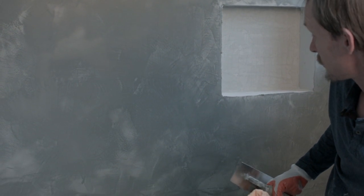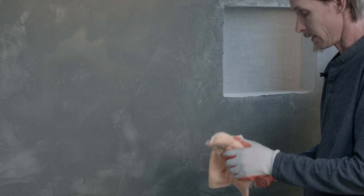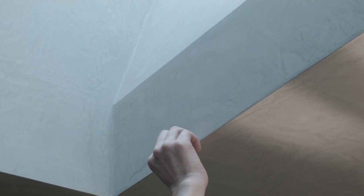Now I can see the shine really well, which means I need to stop troweling pretty soon — the more I trowel it the busier it'll get. I kind of like it to not be really busy in the texture so I think I'm just about done. What I'm doing right now is cleaning up the edges, because when you're troweling it's really hard to get these angles perfect — so you just take a really fine sponge sander and knock them down. Don't sand on the face at all because that'll scratch it up and you'll lose your shine.